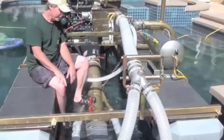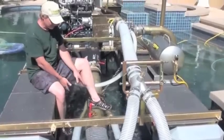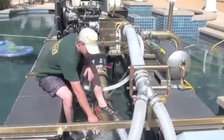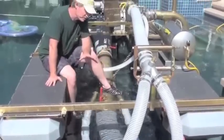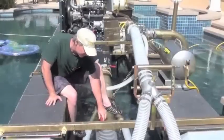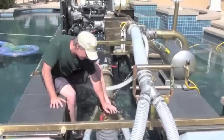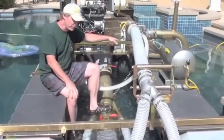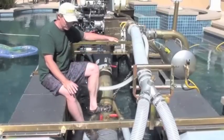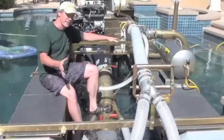Now you can see how the two three-inch pressure hoses come into the power jet. These are called jet logs. Each jet log is injecting around 400 to 500 gallons a minute, so you have a combined water flow of 800 to 1,000 gallons a minute going into the power jet. That means your suction hose is going to pull about a one-to-one ratio — inject 1,000 gallons in, pull close to 1,000 gallons a minute through the suction hose. The suction hose attaches via a clamshell that wraps around it; you slide it in, push the levers down, and it locks in place. There's also an adjustment for tighter or looser clamping to accommodate suction hoses with different outer diameters.